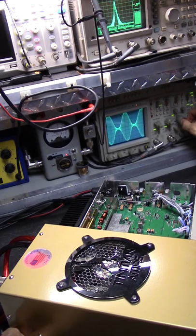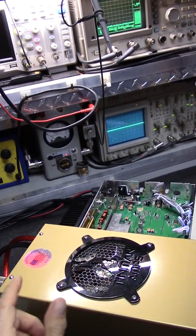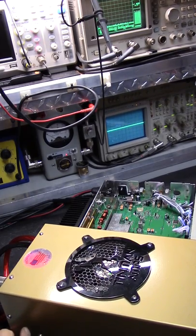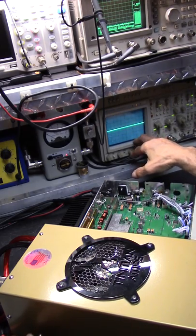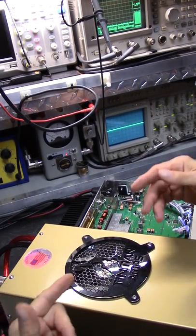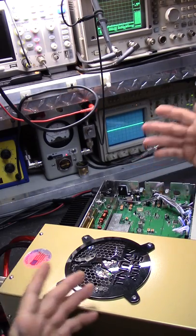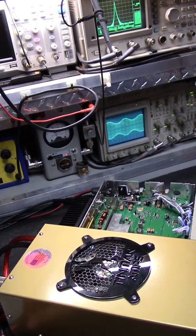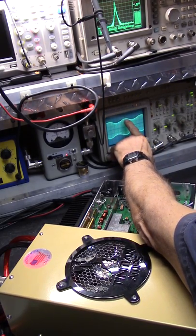Yeah, it will. For some of you guys that don't know what graticules are, I'm going to put a link or an end screen video about AC volts to watts. I explain a lot more about oscilloscopes there. If you need to learn more, then start studying. But there are 8 divisions vertically and 5 graticule, so if you figure 8 times 5 times 2.5, guess what you got? You go both ways, the positive and negative peak ratio, to achieve 100%. 100% is too much, but you can count the ratio and the volts up and down. Study more or just pay attention. So there's 25, 50, 75, or 2.5 per division.